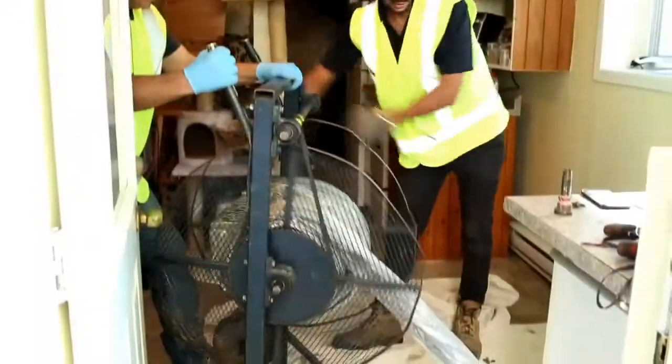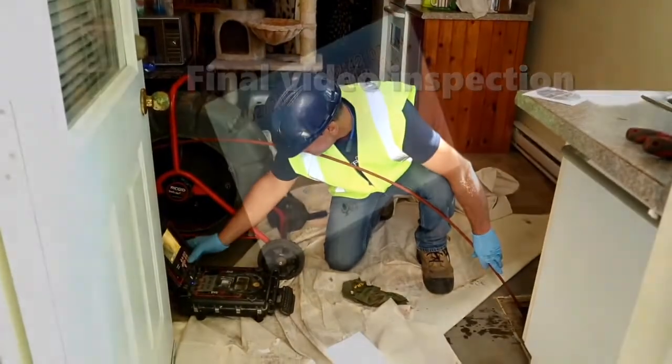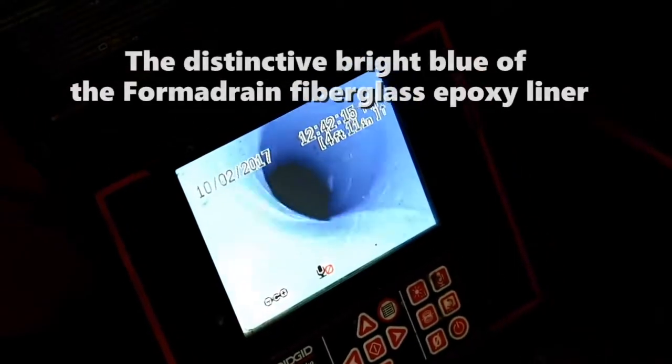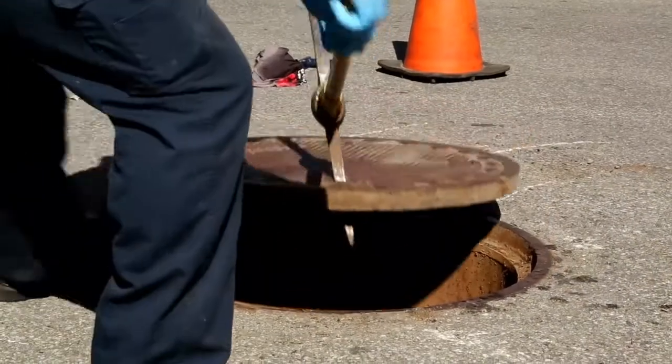After the steam curing, we detach the inflatable bladder and remove it from within the sewer pipe. Once we have the bladder taken off of the new liner, we do another video inspection to make sure the installation was completed properly. You'll notice that after the new FormaDrain liner was installed, there are no cracks, missing sections, or root intrusion. The distinctive blue color makes it easy to spot issues with the new liner upon final video inspection.